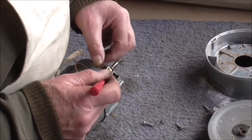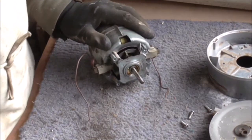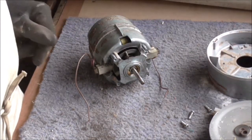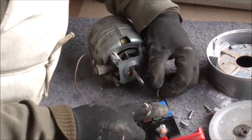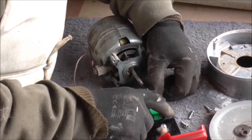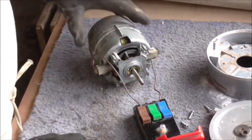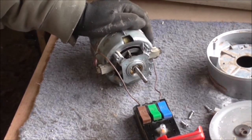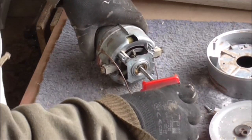Motor parts assembled now. What I thought I'd do before I put the fans on - it'd be wasting a lot of valuable time if it doesn't work - so I'm going to connect the motor up first and see if I can get it to run before I bother putting it all together. I'm just going to connect it up without the fans on and let it run to see if it works. It might be very noisy - I'm going to hold it firm so I don't want it to fly off the bench. When I press the lid down on my connecting box the motor should run.